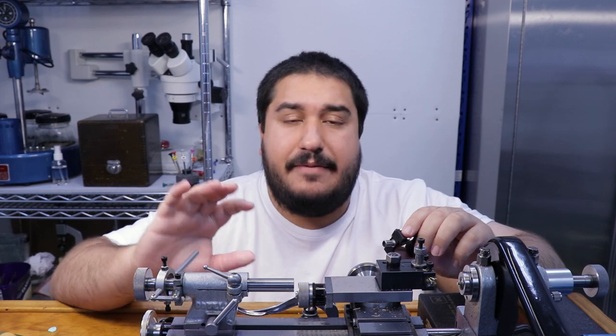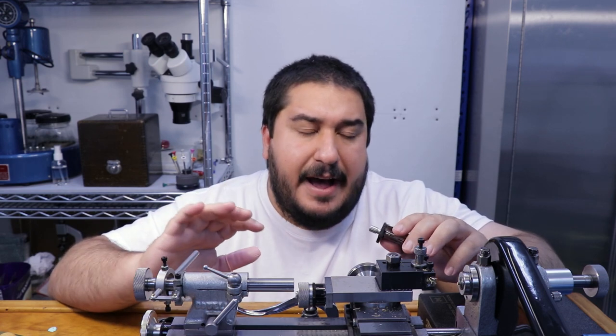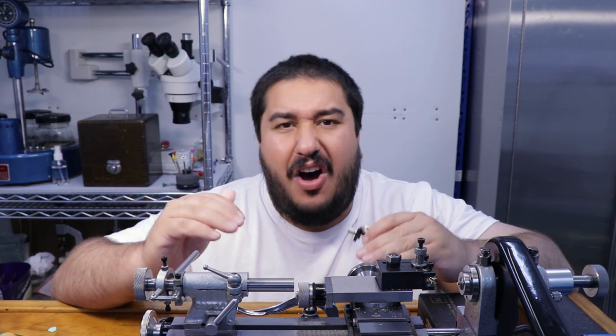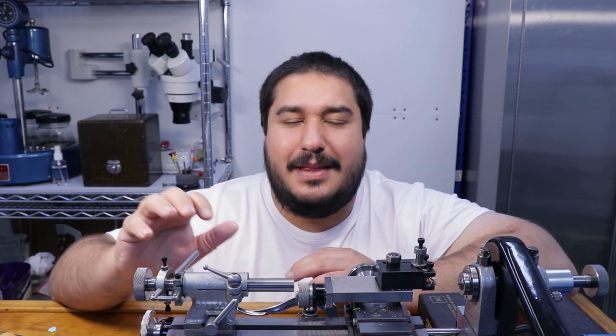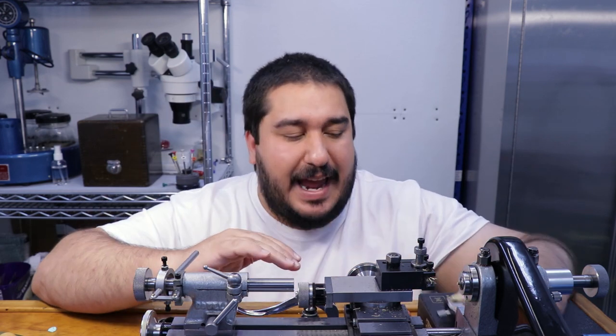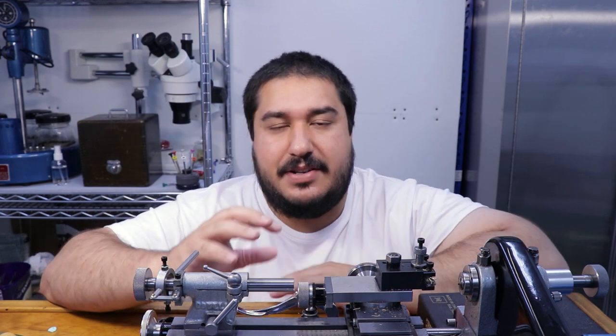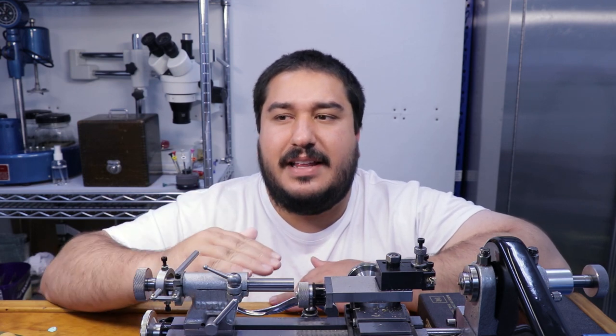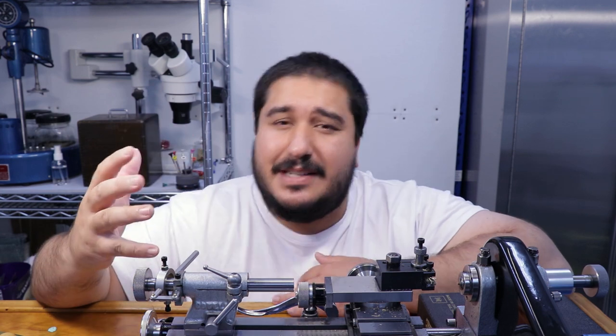And the wheels all have good side shake. I needed to adjust the depthing of the jewel because I was having some height issues with the mill, but I found out the solution to fix that just by having the tape underneath the brass piece, holding it down. It just creates the extra height. And I thought I was adjusting the material height in the software, but that's not the right way to do it.